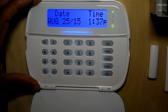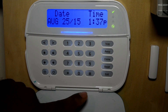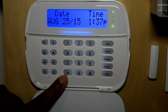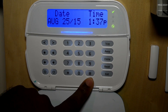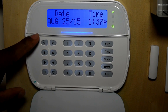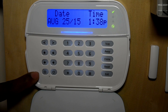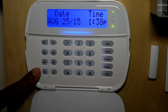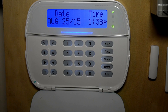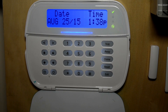At this point we went over all the functions of the keypad — what the lights mean, how the function keys operate, that star is your enter and pound is your clear or brings you back one step in programming. We also talked about the left and right arrows to navigate through menus, and the emergency keys which should always work — make sure you test them. One good tip is to test your system weekly to make sure it operates the way it should. Thanks for watching, I hope you learned something from this video.